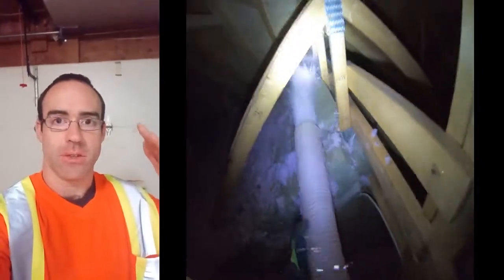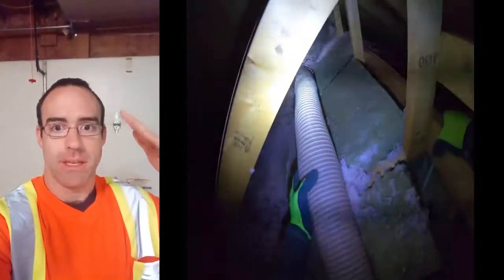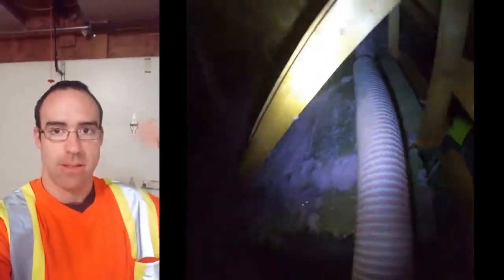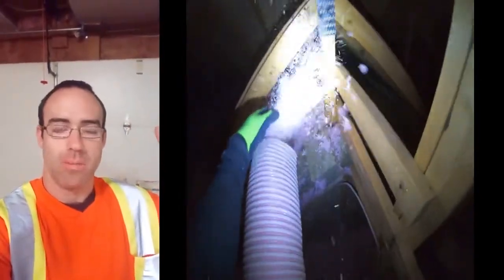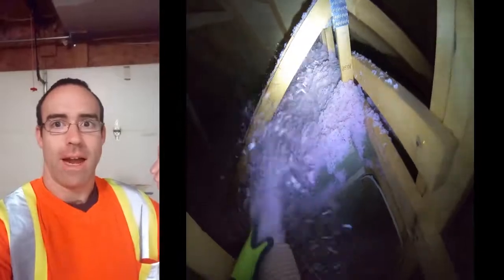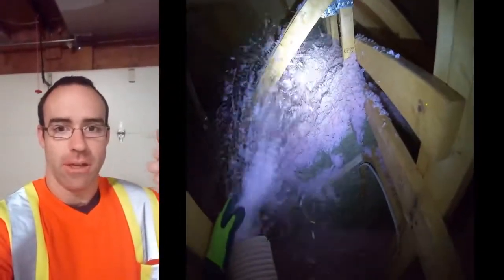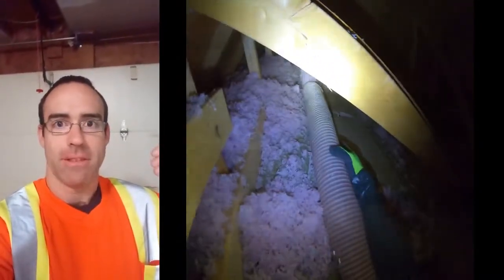You could build a slope ceiling within a slope ceiling. So the slope ceiling that you're creating, you would add additional framing, and it would be a little bit more on the slant. And so you would have attic space that you could access to either blow on top of that slope that I'm showing you right now. This shows an example where I'm able to crawl in there and then install loose fill insulation on those slope ceiling areas. It is a little bit difficult, but I have done that.